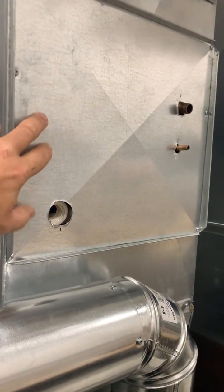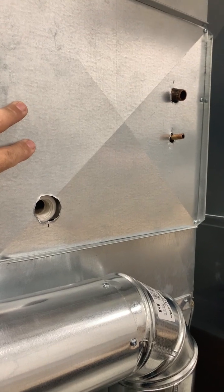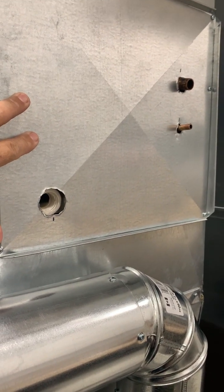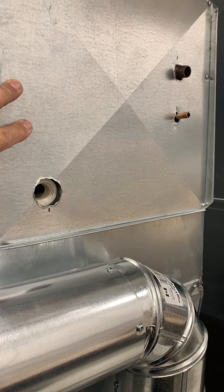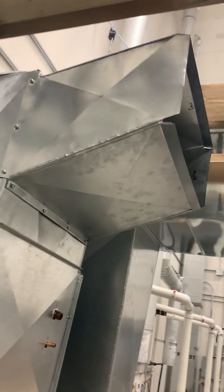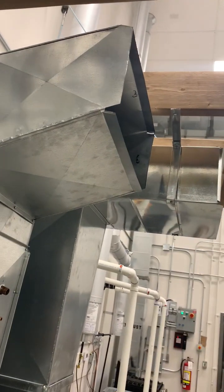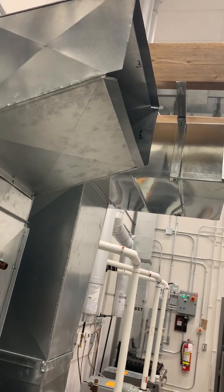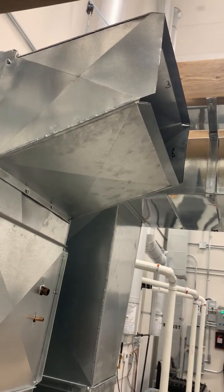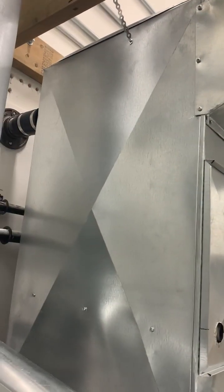If you have central air conditioning, an evaporator coil can be installed in the supply air plenum — that's the indoor section of the central air conditioning system. In winter, it just sits there without doing anything, and heated air passes through. The air then exits through a plenum takeoff (PTO), runs into pre-purchased ductwork extending across the room, with takeoffs delivering heated or cooled air to each individual room of the house.